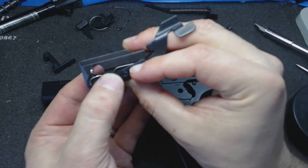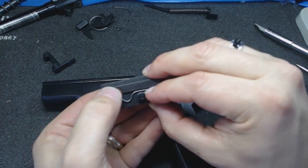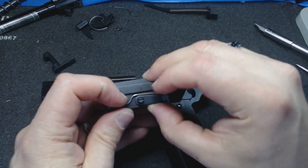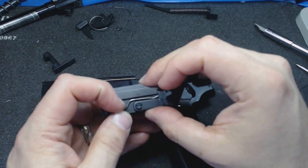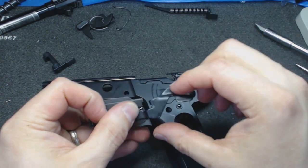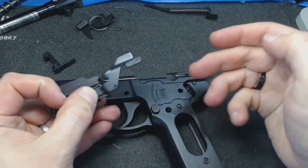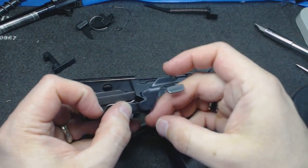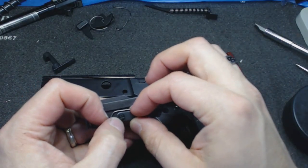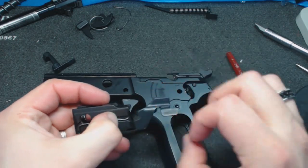This same spring that was creating tension on that takedown lever, when the takedown lever is in place, it's actually pushing this spring down. And when that spring pushes down, that pushes this down. And that means that this lever is being held down normally, and some force, like the magazine itself on the last round, lifting it up, is what has to happen for it to lock back. And once there's nothing pushing on that, this little spring will make it return back into the unlocked position.